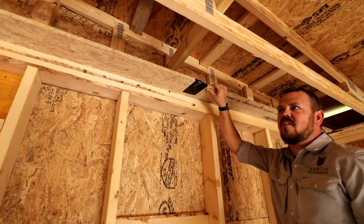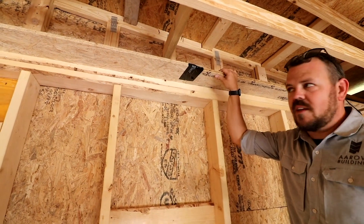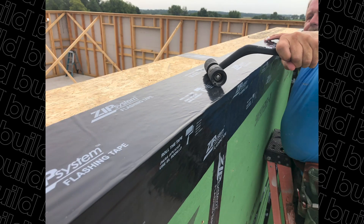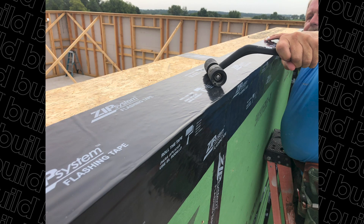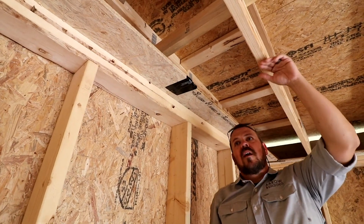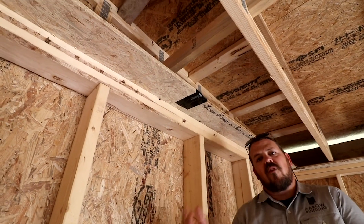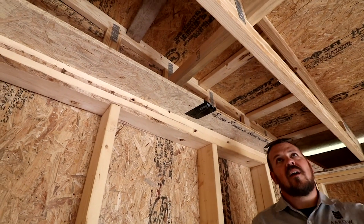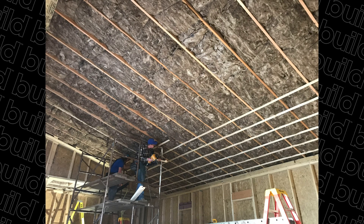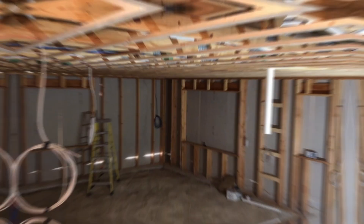This little piece right here is our connection. In our case, this is a piece of leftover three-quarter Advantech subfloor. This piece goes to the outside of the sheathing — we are zip-taped from the sheathing onto the Advantech, and you'll note our seams are taped here. This puts our trusses sitting three-quarters of an inch up, and that ability to be elevated three-quarters of an inch gives us an opportunity to strap our trusses. If you frame on the east coast, you know what strapping looks like — three-quarter by two-inch straps running every 12 inches. That gives better support to our drywall and the ability to flatten everything off if there's any variation in our trusses.